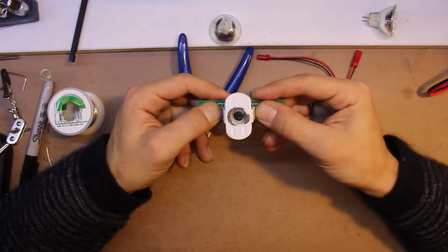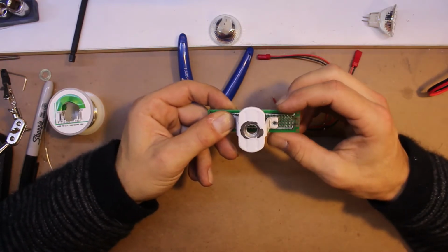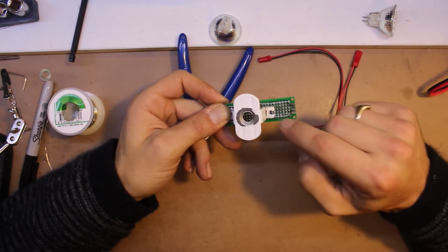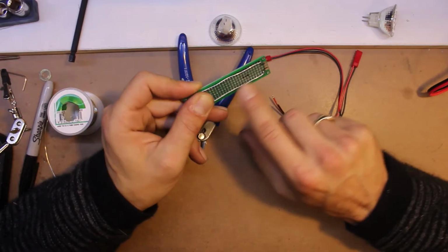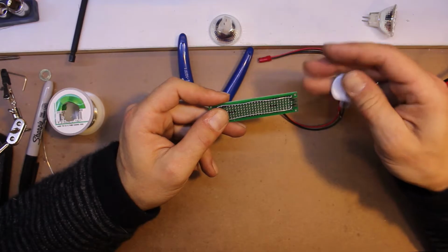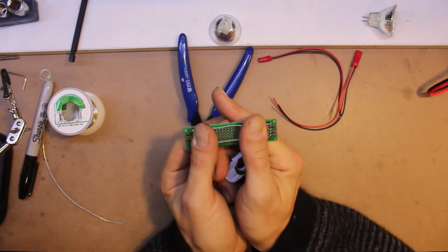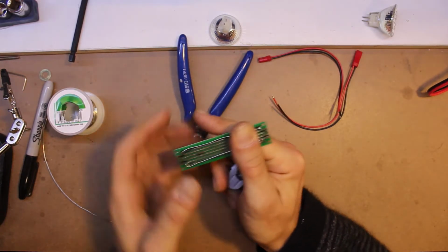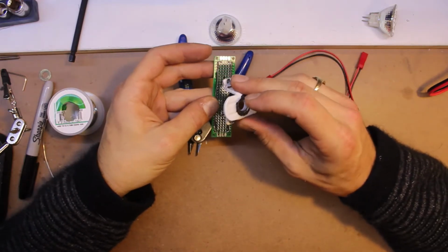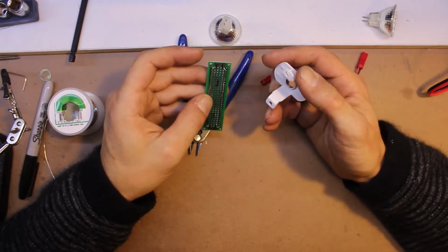See, what I'm thinking I'm going to do is I'll lay down these tracks, drill it, and then I'm going to heat shrink the whole thing. So this will be insulated. These two wires will be well insulated, and I'll put goop on here as well. And then I'll heat shrink this middle section. So it'll just be the ends here that'll be exposed. And then on the ends, I'll be able to solder up the thing. And that should make it electronically safe, because this will be insulated from this by the heat shrink and nylon screws.